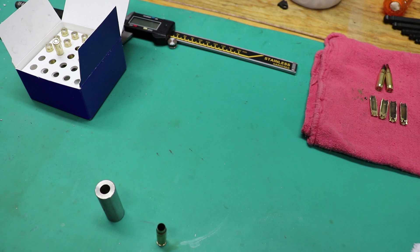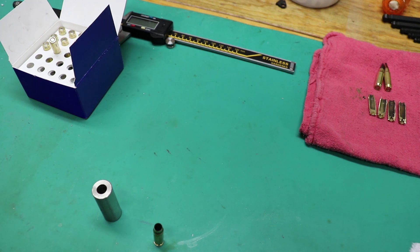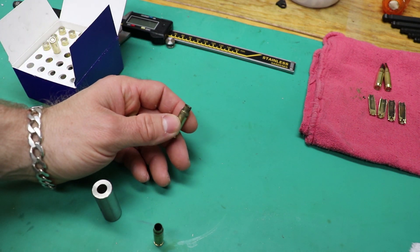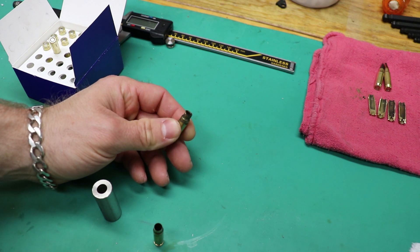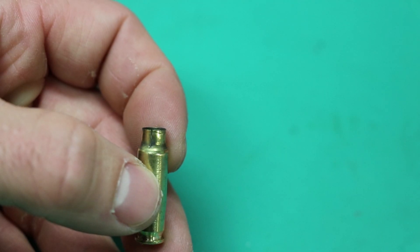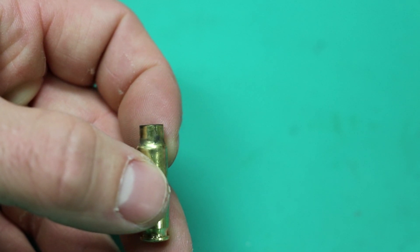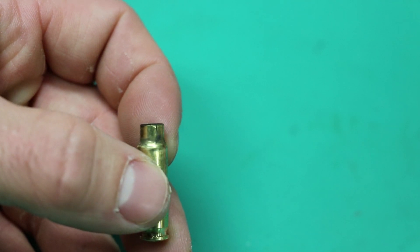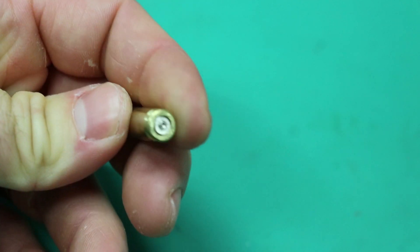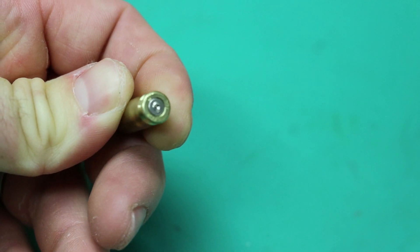It's time to express some opinions and concerns on this new brass from Elite for 5.7x28. Obviously 19 rounds is not enough to go either thumbs up or thumbs down. It did function well out of the 5.7. The PS90 did okay, but a few of the last rounds were getting stuck between the bottom of the chamber and the bolt, as if they weren't coming back far enough — you can see this one got mangled up pretty good. I did find a split neck on one of the recovered 5.7 pieces of brass; this could mean they need more annealing time for the neck. The primers look good — they're not crimped yet and still have a good edge on them, they're not flat.